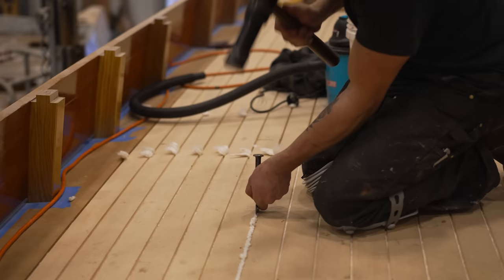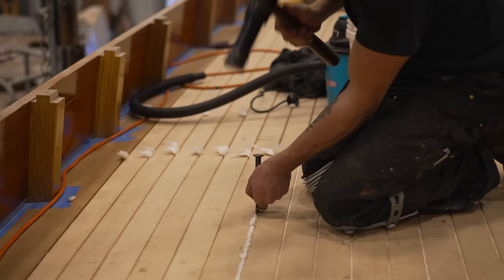The deck is in yellow cedar, which is a pretty soft material, so we have to be careful about how hard we caulk it. We do need to develop enough tension in the deck to keep it watertight. Building that tension creates a big rigid structure that won't have movement or flex. The deck is pretty heavily built and has all that diagonal strapping which helps increase rigidity, but the deck caulking is important in basically taking all these individual strakes and pieces and making them act more as one congruous unit.